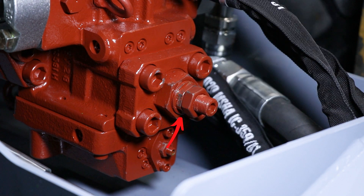Keep in mind that when you are adjusting the low speed adjuster screw, the high speed adjuster screw will turn with it, so this screw will need to be reset if you are only adjusting the low speed. Generally when you need to do a speed adjustment, both speeds will need to be adjusted. So the rule of thumb is to adjust only the low speed, and then turn the high speed back half the amount of turns. This way both the high speed and low speed will be adjusted while keeping a 700 RPM difference between the speeds.